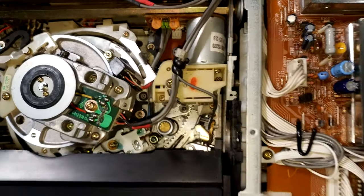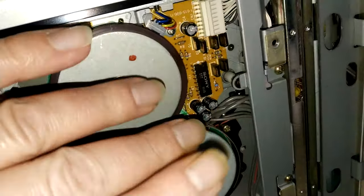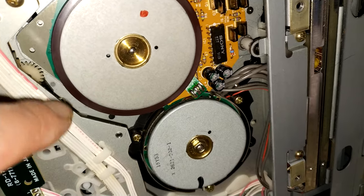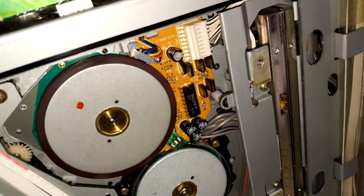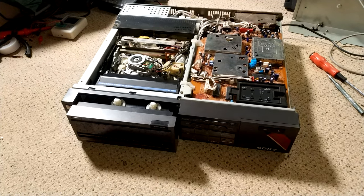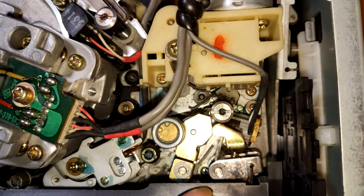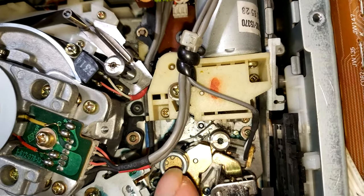All installed and it actually went fairly well. It is a bit of a fiddly way to do this. The biggest problem is getting it past the gear — but if you just gently rock the motor and manipulate it, it will eventually slide past with no force required. You don't want to put force against that gear. Then it locates in place, put the connector back on, and you're good to go. Well — that's fixed the problem! I now have a properly running capstan. I did have to slightly adjust the angle of the capstan because it was crinkling the tape, but that's fine.